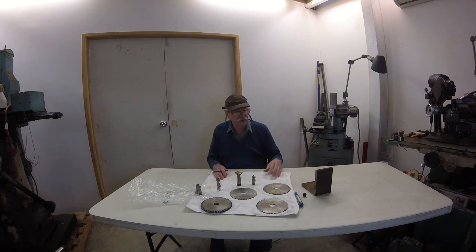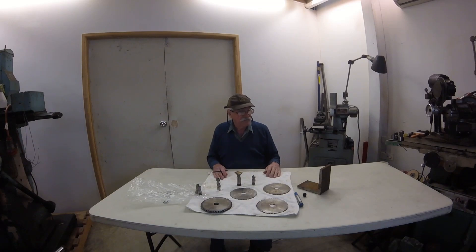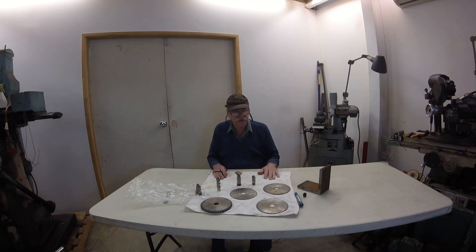Things that have happened since last weekend: I've got a nice piece of heavy angle, a bit of 150 by 150 by 12 or 13mm, half inch. And that will be the start of the motor mount bracket to get the Cincinnati tool and cutter grinder up and going. There will be a future video on all that. It's sturdy enough to be a good bracket — I don't even think I'll have to gusset it. I may if I get vibration but somehow I doubt it. That's quite a good piece of steel.